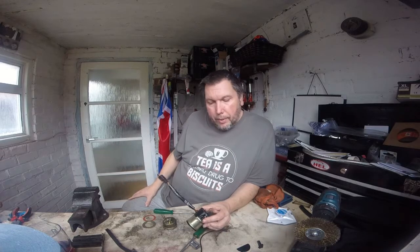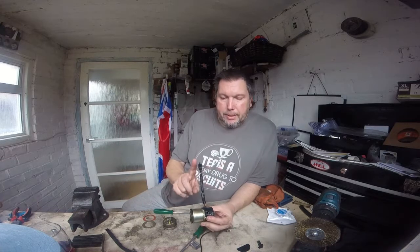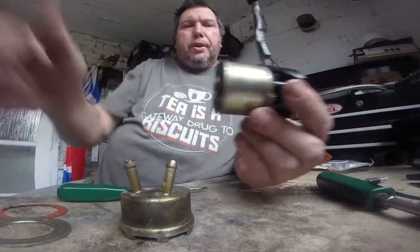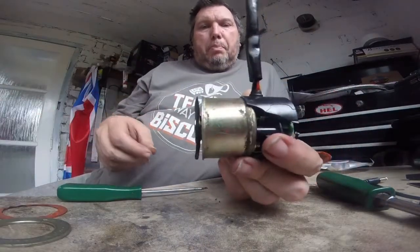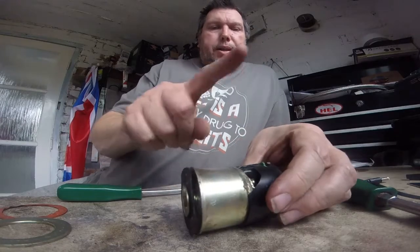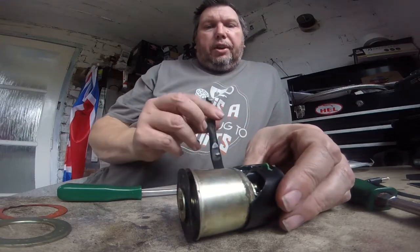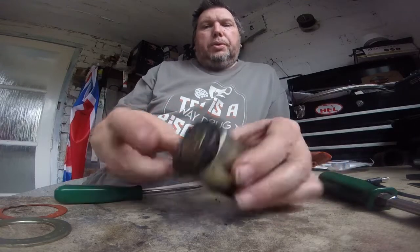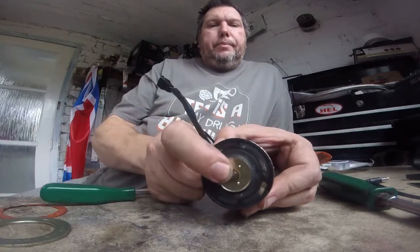I didn't know whether it was a geared pump or whatever, but it's a diaphragm pump, and basically there's an electromagnet in here. Let's get you down here so you're close to the action. Anyway, there's an electromagnet in here, which is controlled by the circuitry. So when you thumb the starter and the bike's running, this will pulse, and this will pulse like that.